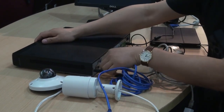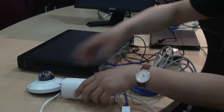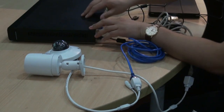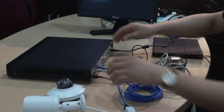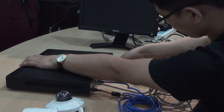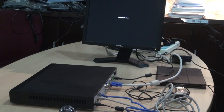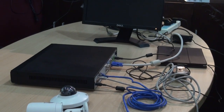Make it just like the installation of the CCTV DVR. Use the BNC cables to connect the camera and the DVR. This is a network cable to connect the IP camera and the NVR, and also the network cables for the NVR.